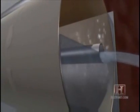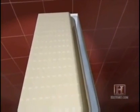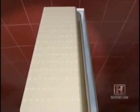The mesh of the wire is so small that it captures the fibers. So as the fibers are draining, they accumulate in the low areas, they're sloughed off in the raised areas, and the resulting sheet of paper has this reduction in opacity where it's thin, increased opacity where it's thick. Held up to the light, it produces that multi-tonal shadow look of a watermark.